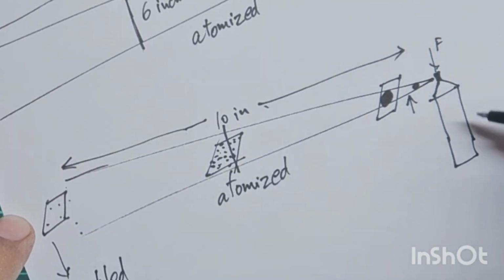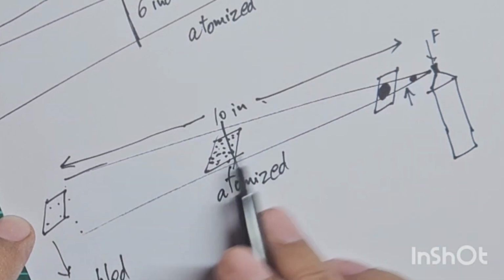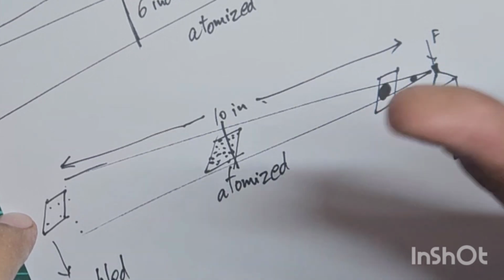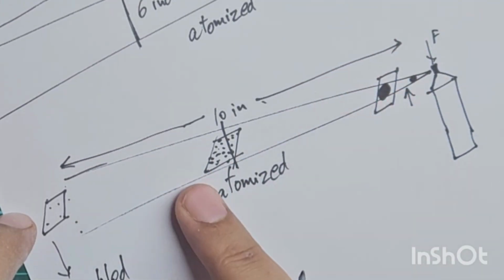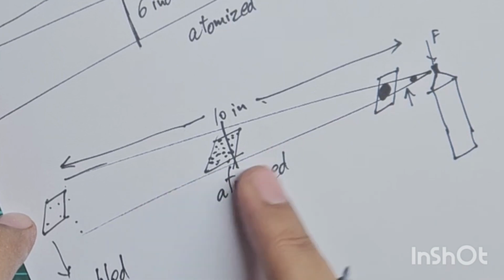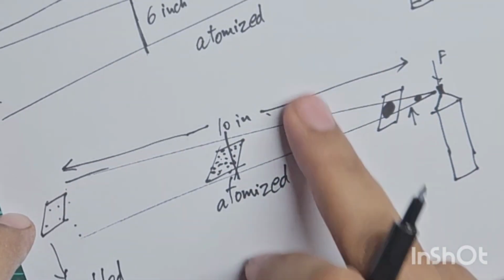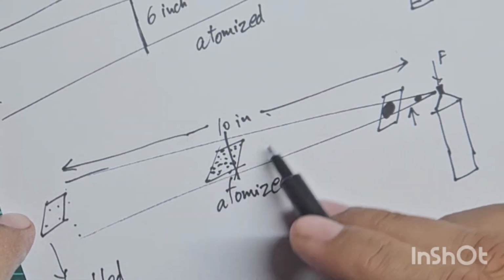And as we discussed here, as the volume of the mixture reduces, the effectiveness of the conical pattern also reduces. So that's why when you're beginning to paint, always test how far the spray pattern is going. That'll give you a fair idea of what's the center point of that effective range, and that's where you can place your subject and you can get a good spray coverage.